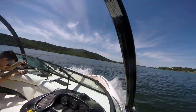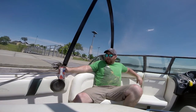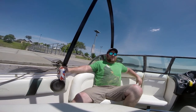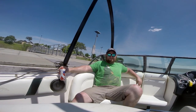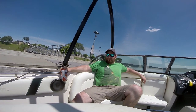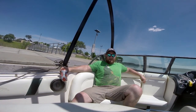Finally out on the water. Well, had a really fun 30-minute boat trip. We got over to a cove, were just chilling and having a beer — and the transmission started slipping. We played around with it, let it cool off, and it came back, which means the friction discs in the transmission are done. That means another $500 and another automatic transmission to rebuild. I am most displeased. When I did the trans fluid, I only pulled out maybe half a quart, so my guess is this boat sat for a long time and the transmission discs dried out. There will definitely be a part five with transmission rebuild stuff. You know what they say — best days of owning a boat are the day you buy it and the day you sell it.